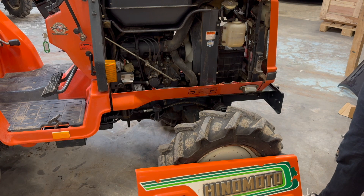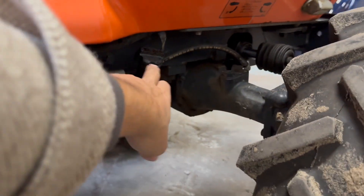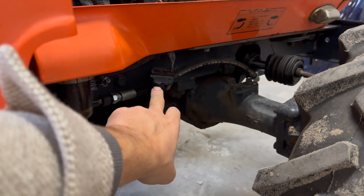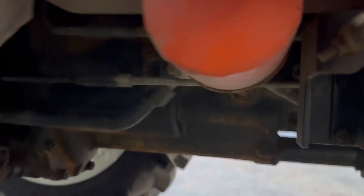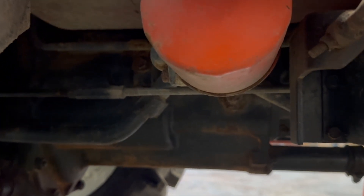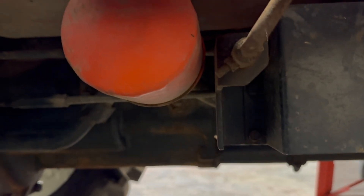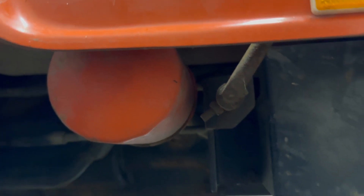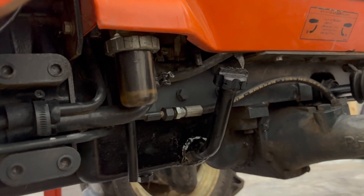I can't really say that because I'm a big fan of Iseki, but still these tractors are really good. One of the last details: here is the oil dipstick, and you can also fill the oil here. And here's a hydraulic filter — many people always forget to change them. They are not expensive, like 20 or 25 euros, but very important to change. Otherwise small sand and metal pieces get into your hydraulic system, things block up, and people think their hydraulic pump is broken — but most of the time it was just a clogged hydraulic filter, and your complete PTO or three-point hitch will stop working.